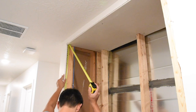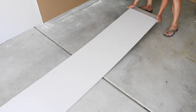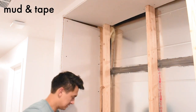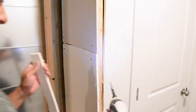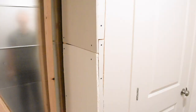Now for the sides: get the height and depth of the sheetrock you need and go cut it. If you're cutting big pieces, you can just score the sheetrock a couple of times on the finished side, flip it up, snap it back, and score the back. I inaccurately measured on one side but fastened it anyway — that's where the beauty of mud and tape comes in. Don't forget to do the other side. I cut way too much sheetrock in my initial cut, so I went back, cut small pieces, and screwed them in.